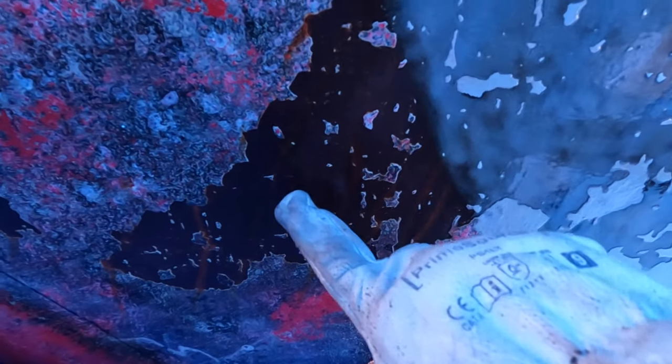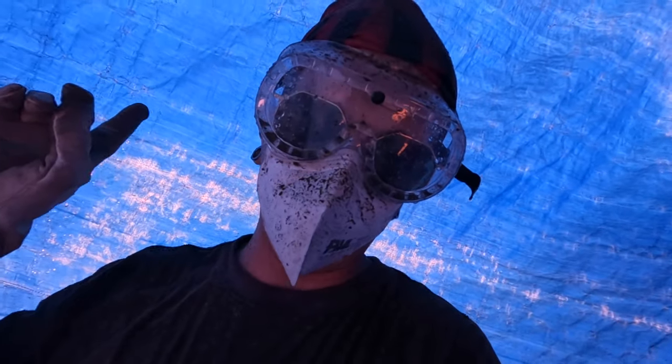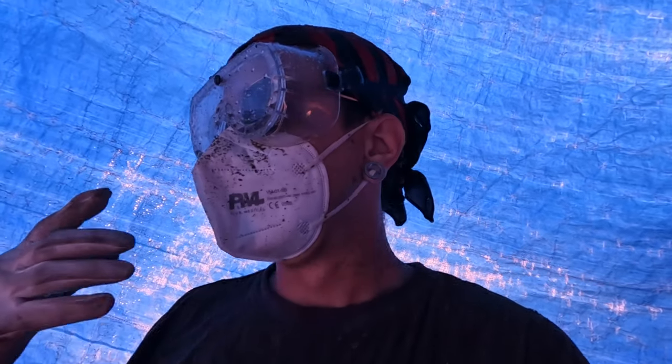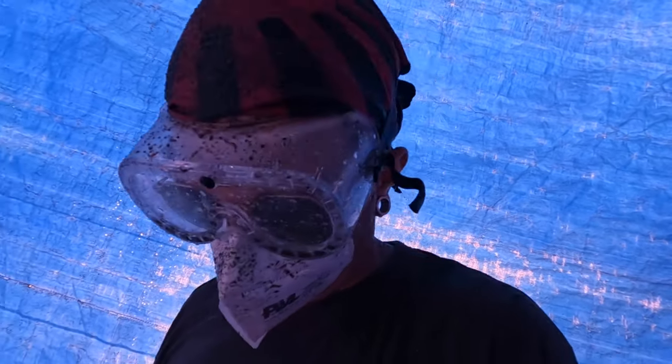Inside the tent, about one square meter is now done using one 25-kilogram bag of sand. You can see where the work stopped. There are places where we went down to bare steel — here the steel looks gray and shiny again. The surface looks great for painting but it's wet now. The big question is how much flash rust will develop — whether this method makes sense for a steel boat going all the way back to bare steel.